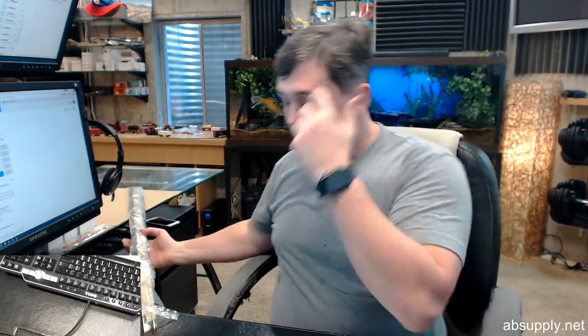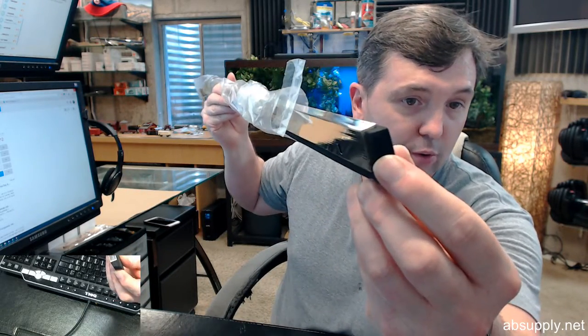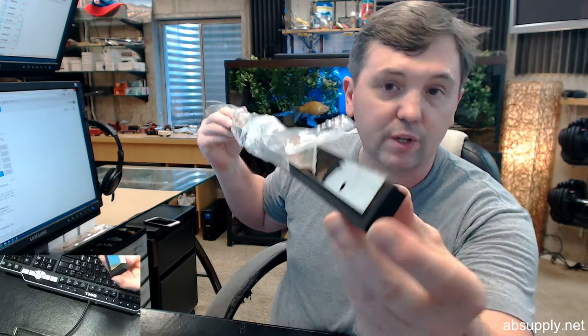The E stands for extruded, and that holder, or the L angle on the solid brass material, is extruded, versus a much thinner style that Dorbin will have of the same sort of product. It might just be an 82BN without the E, and it's a roll-formed piece of architectural bronze, which is simply much thinner. Let's take a look at that part number just so that you have a comparison. What I'm doing literally is looking in the catalog for what the other part number is called. Indeed, 82BN, and that will be a roll-formed piece of much thinner material, and it will utilize the identical sponge neoprene.